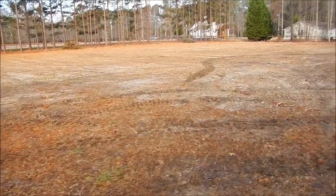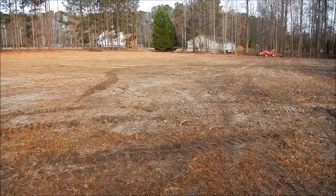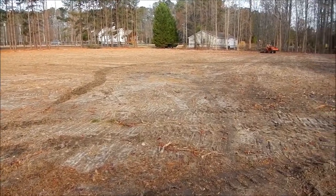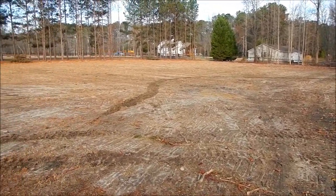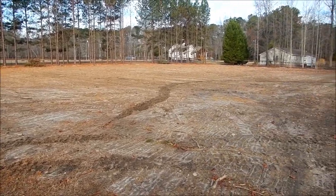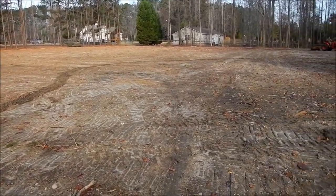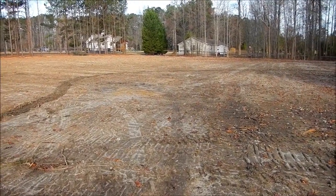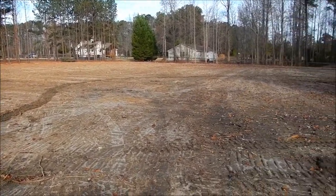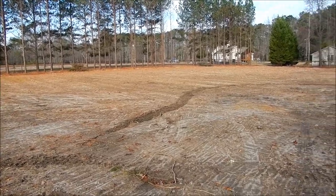Here's day one on the horse arena project. It's going to be a 200 by 120 riding arena. Somebody else had already done the clearing, so we're going to do all the grading and site work. We got about a three foot cut to do over there, push it over here and pack it in, roll that out, and we'll put in all the screenings and railroad ties to make a border. Should get all the dirt moving in the next day or so.